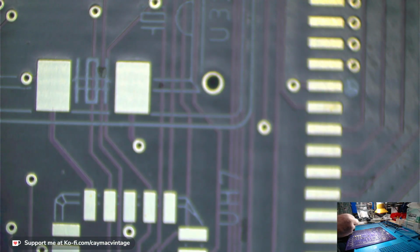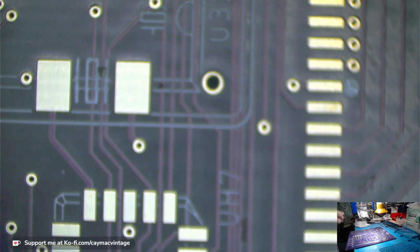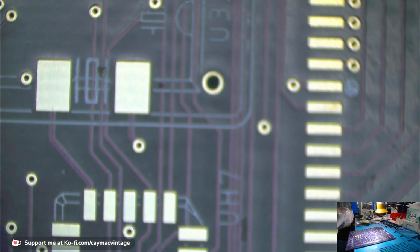I got two crystals here I can go ahead and put on. The other crystal is one that we designed ourselves, because I like to use more of the surface mounts, but this one was not available anymore as a surface mount because of the right size. So Jake, my other team member, made an adapter board that we can use to mount this one.